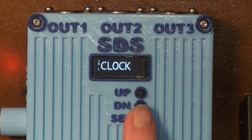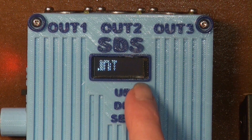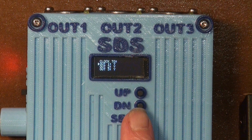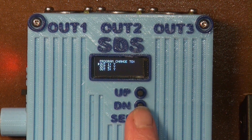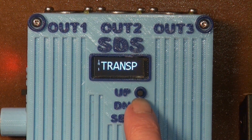There are instruments for each section that are auto-updated when the first note is played, or can be disengaged entirely. The MIDI clock sync can be routed from any inputs to any outputs, but if there's a conflict then the other input will lose its routing to the same output. I had planned to make this automatic but for my own use I don't really need it at this time. Entire program change routings can be disabled as well — some of my synths I like to manually set the preset, so I prefer to block them in that particular routing scenario.